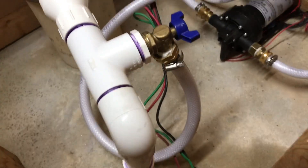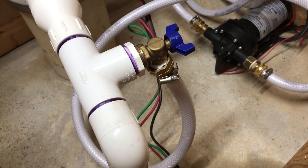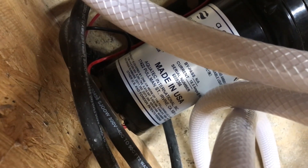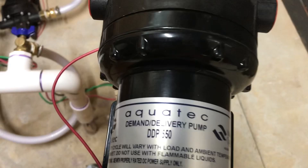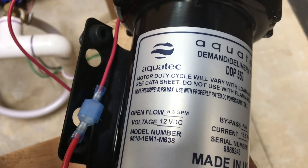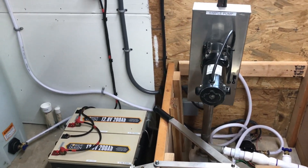It pushes in right here, can't go toward the casing because of the check valve, and just goes down into the house filling those pressure tanks — just like a regular well pump. If you were inside the house you would not know whether you were on the booster pump or the well pump, it works that well. Here's a close-up of the Aquatech pump — this spare is the same model used in the system: Demand Delivery Pump 550, 5.3 gallons per minute, 12-volt, 18 amps at 60 PSI. Aquatech is made in the USA.